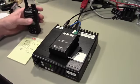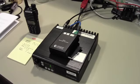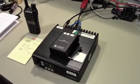That being said, I have barely scratched the surface on the SR1 capabilities. This is a very, very smart little box that Scott's put together. It's got a voicemail system. It's got voice beaconing, so if you want to put news and updates that get beaconed periodically on this channel, you can do that. It has an on-off switch so that you can have it standing by, and then key it and tell it to act as a simplex repeater only when it's needed, so that if everyone happens to be in range of each other, you don't have to deal with this long, protracted repeat of everything. But that's totally dependent on what you want to do with it.